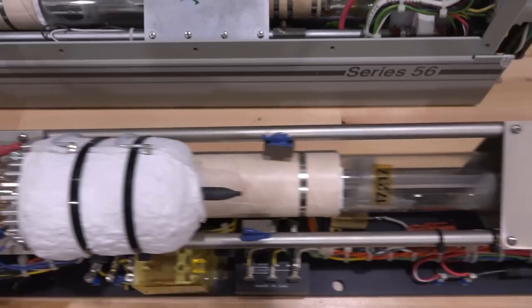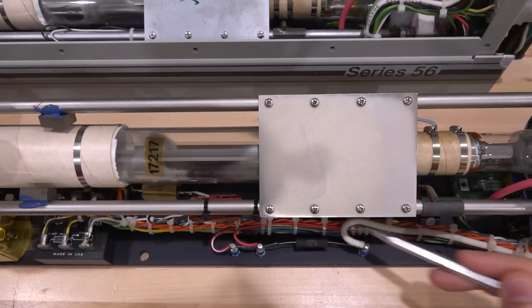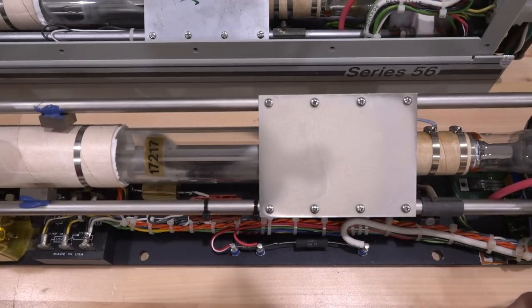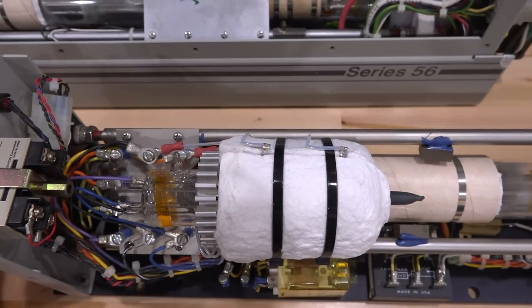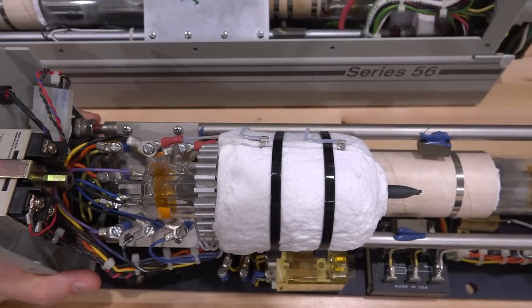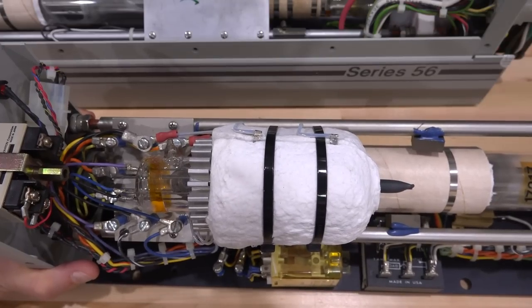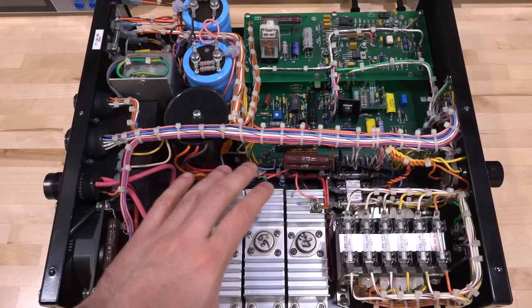There's also a one-megaohm resistor here — this is the feedback path of the high-voltage power supply; that's how it measures to make sure the high voltage is present. Something dangerous happens when the cathode filaments are dead: the power supply basically goes haywire and thousands of volts above the rated voltage appears at the end of the mirror. You can even hear the crackling noise of the high-voltage power supply when these filaments are dead — that's how I originally found out. Here's the power supply and just look at the workmanship, the wiring, all the zip ties keeping everything under control.